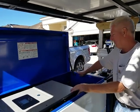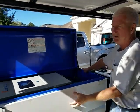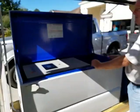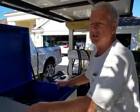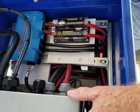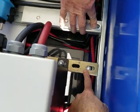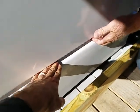We've constructed the power station with a number of thoughts in mind. One is we wanted to create it in a robust enclosure. So we started with what's basically a job site box, which is lockable. It's heavy gauge steel, weldments, and rather than do what we did in our first or second generation power stations, which was use PVC or hybrid materials to mount everything, we've used structural components. So we've used some channel strut and large bolts like these, 1/2 inch diameter bolts. And we've created a frame, and this frame rests on the structure of the enclosure itself.